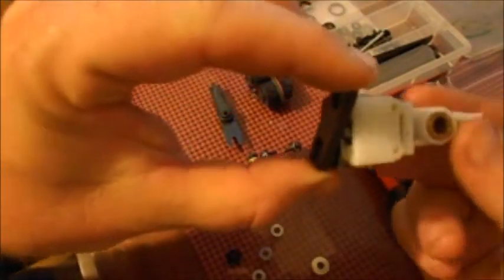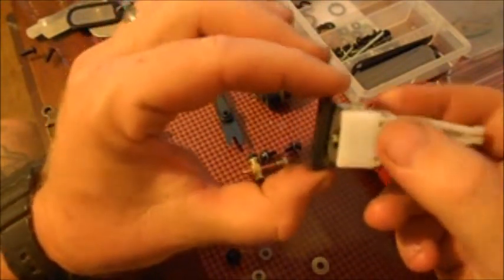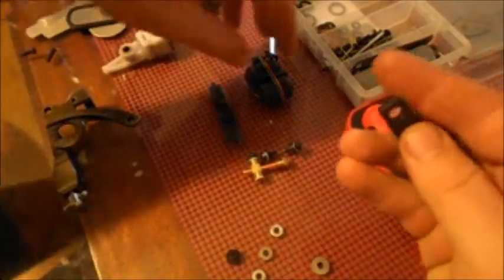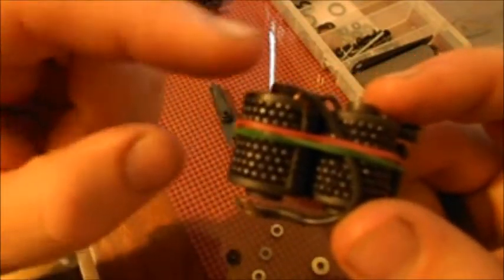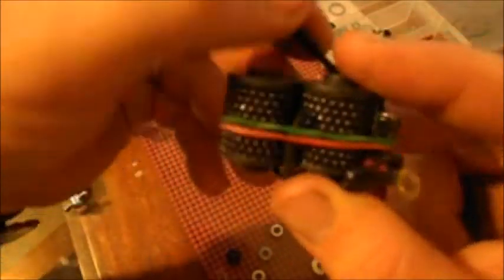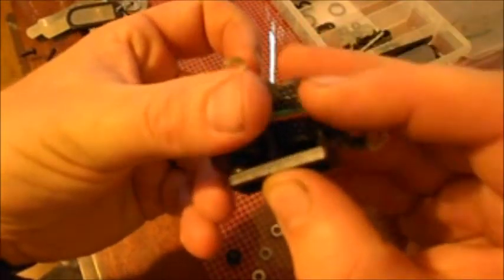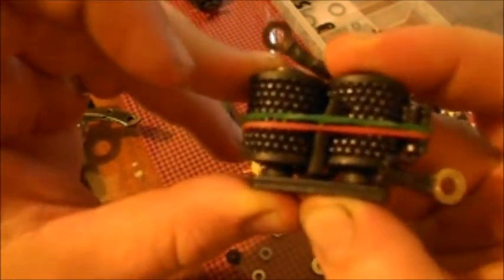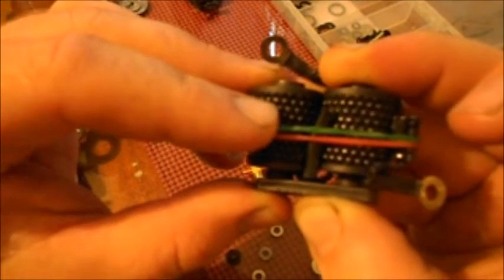See? Now, the yoke, what it's going to do is make sure that when you have your cores, it's kind of like you have one magnet here and one magnet here. So if you put your yoke down there so that it's touching your cores, instead of having two weak magnets, you have one horseshoe magnet.